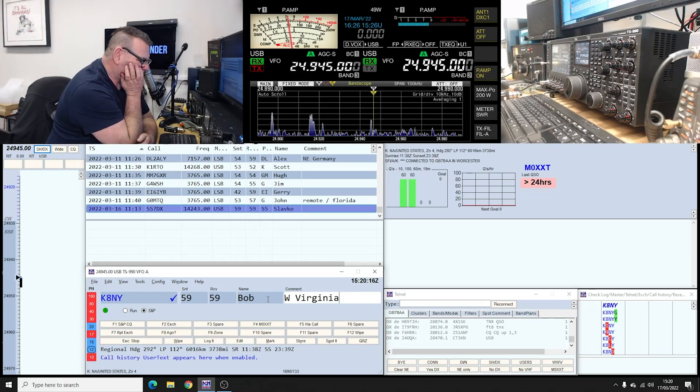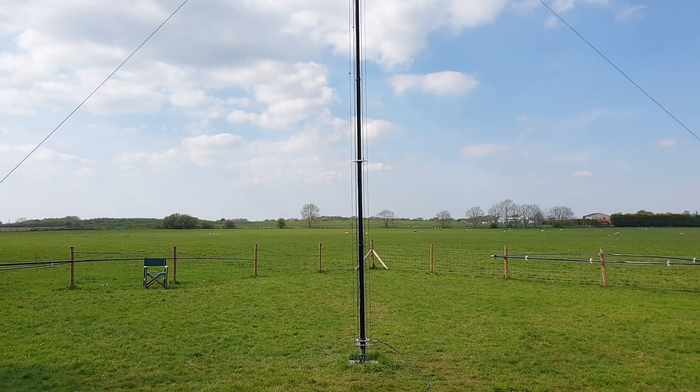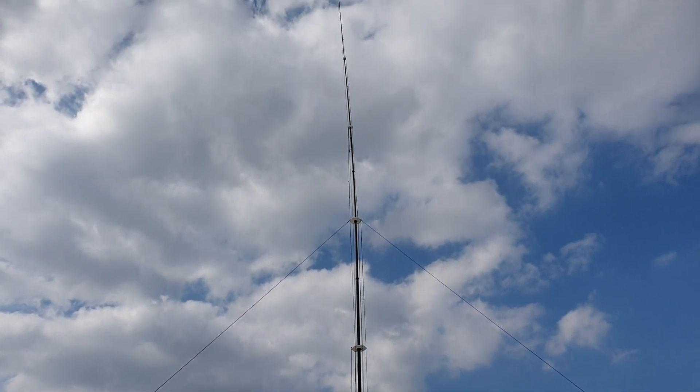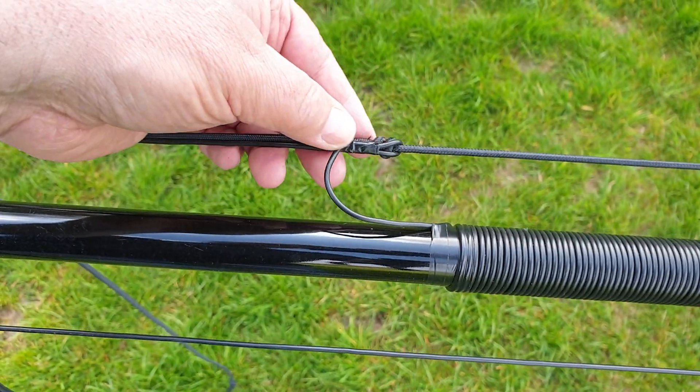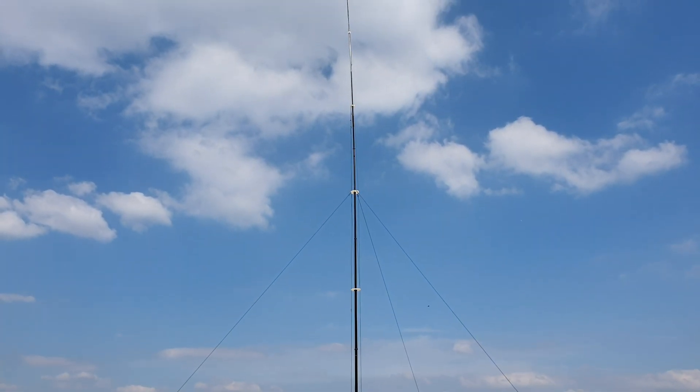Mike Zero X-Ray X-Ray Tango broadcasting station — welcome back ladies and gentlemen. When you apply a loading coil on an element, very often you'll find you had an SWR curve that looked nice and wide, and you put the loading coil in, get it all tuned, and it becomes tighter. That happens — that's just the way it is. What I was worried about on the 12.4 is applying this coil and having an unusable bandwidth. It turns out we've got about 100 kilohertz.